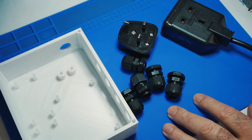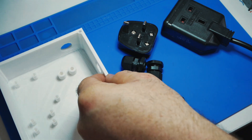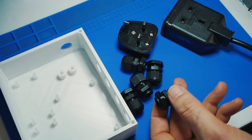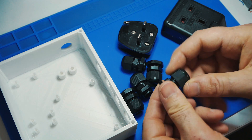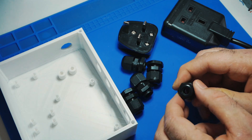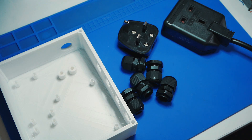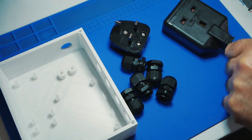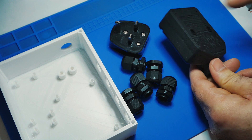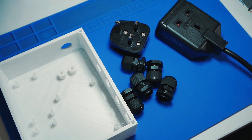Here are a couple of the other components we're going to be using in this project. These are grommets — they basically just slot into these holes that I've created. Typically they can be used for waterproofing, but the way I'm using them is for strain relief when the wires go through here. When you screw this on it actually tightens up inside there and stops the wires from pulling around. That's just a plug for the UK socket, but you can use obviously any plug you want. This here is for the extension part, which the extractor fans will be plugging into. You can buy these quite cheaply on Amazon, or if you have an old extension lead you can just snip it off and use that instead.